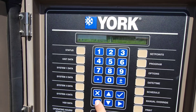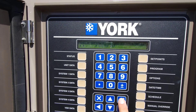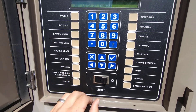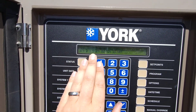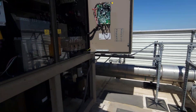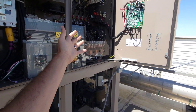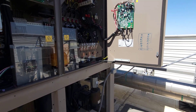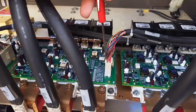I'm going to reset the lockout, then move system one to the on position and go to system two and move it to the off position, so we can get one online. Back to status and then we'll flip it to on. We've already got flow — automation is calling. We're doing a pre-charge, so we'll see, because two things will happen: either it's going to explode and come out of the panel, or it's going to turn on and run perfectly.